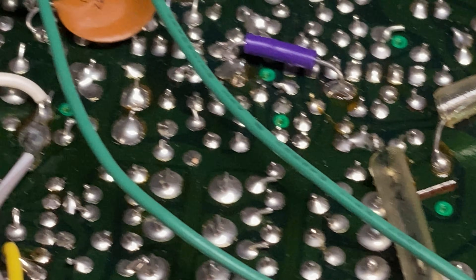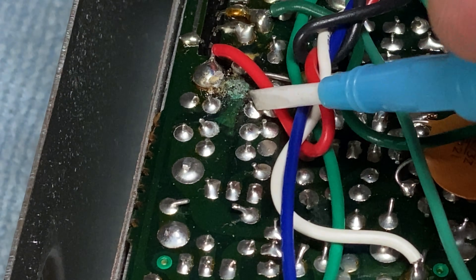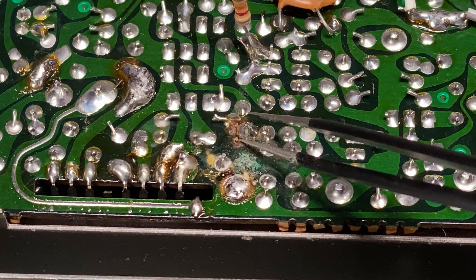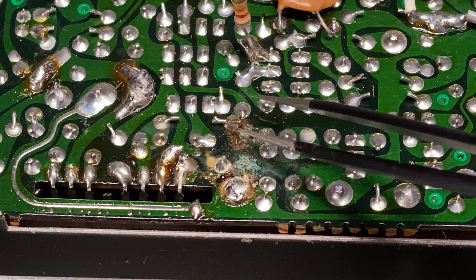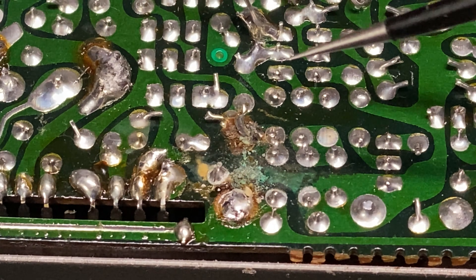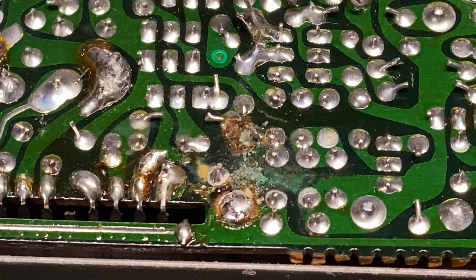But what will cause us trouble is this — I didn't notice it at the start but looking closely this area is quite rotten. Taking all the wires away that connect up to the selectcall, looking at the area, the same thing's happened again — all the solder has gone brittle and it's actually started to devour the copper traces as well. Bits of it are just flaking off, so I'm going to have to do some work to get this area happy again.